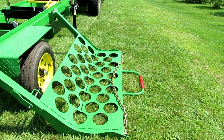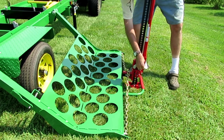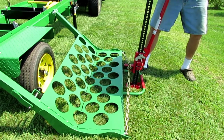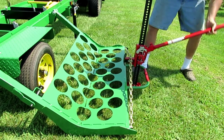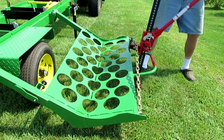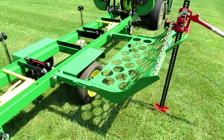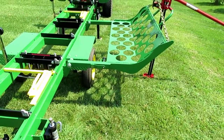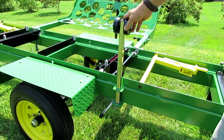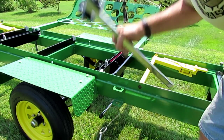For the loader to operate, first you roll a log onto the loader plate right there, then you just mount the farm jack in there. You're easily able to jack up to about a 2,000 pound log to load onto the trailer. As you can see, the loader tracks up so it's just level or a little bit above the trailer for easy loading of a log. On the other side are some stops to allow you to roll a log and keep it from falling off the trailer, but when you're using the mill you have to remove the pin and just pick them out of place.